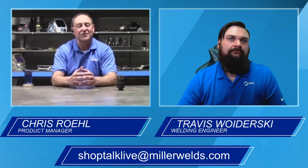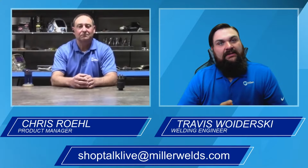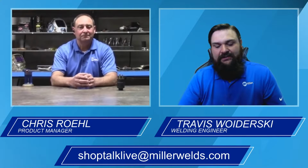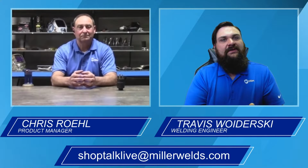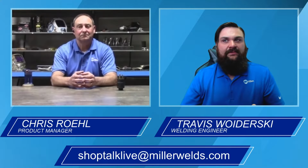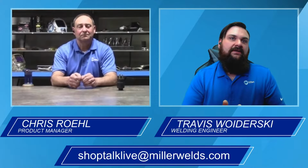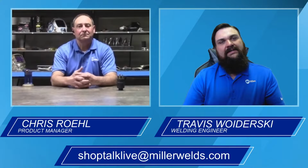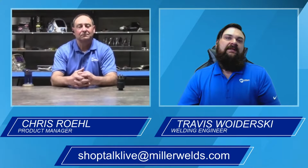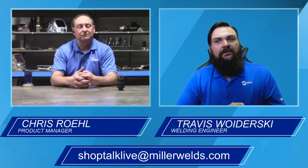That way we're protecting the LCD from the dust and dirt and grime in a typical weld shop. And like Chris said, that's not brand new to the market, but compared to the older dial style machines, it's a night and day difference in what we can display to the end user as far as the setup of the process or the machine. A lot of these newer style machines will tell you with an error message right on the machine if something is wrong. Say on the 220, I've got it set up for MIG welding, and I switch in the settings to the TIG welding side. It's going to tell me that I need to change my cable setup before that will work. So we can display a lot more information than we could in the older style machines.